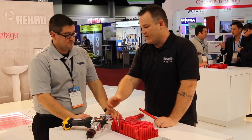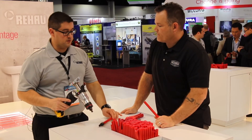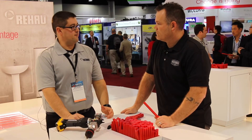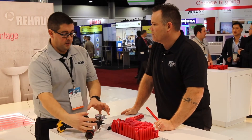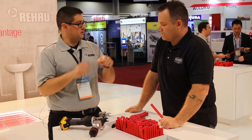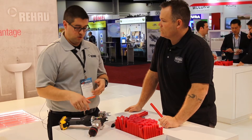So this is available for larger diameters? Yes, this standard tool can do anything from 3/8ths on the small side up to and including 1 inch. As you get into the larger sizes, there's a separate tool that does the 1-1/4, 1-1/2 inch, and 2 inch — just a larger version of this same tool. The tool head assembly is upsized about 50%, and the form factor is more of a pistol grip drill shape with a side handle for easier use.